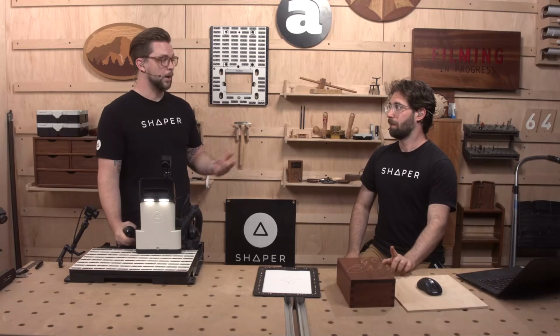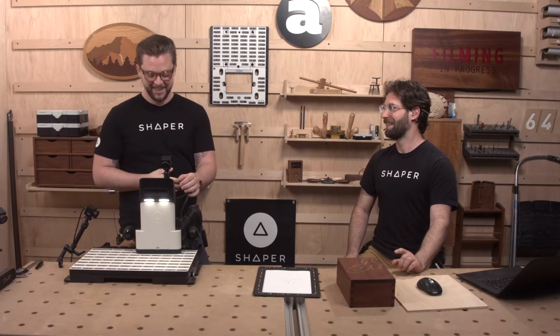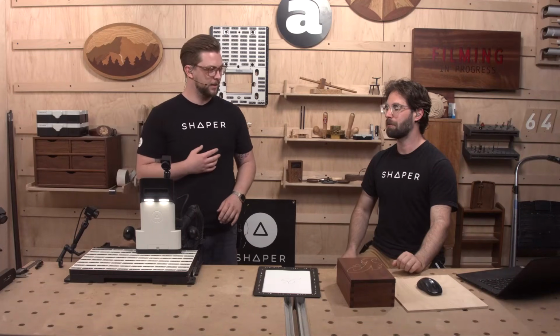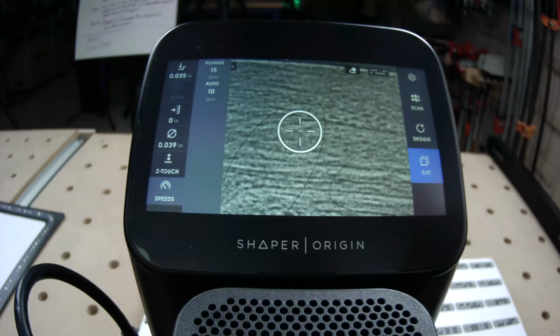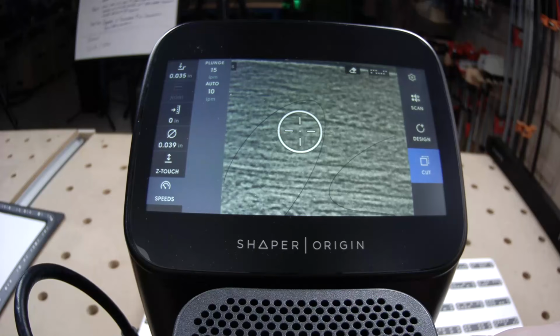Let's talk about speeds. Because right before the show, you said, holy moly, that auto speed is too fast. Yes, it was. Somebody was doing some engraving and had my auto speed bumped up to like 35 or something. Something very high. I was doing a bunch of helixed holes. As long as you can hang on, you're good to go. Auto is the speed at which the spindle travels when you're holding the auto button. I'm not doing a whole lot of auto, but I bumped that down to the default. My spindle speed is going to be 5.